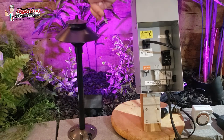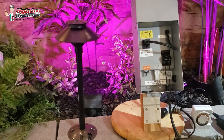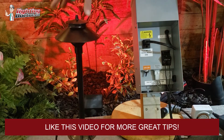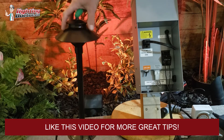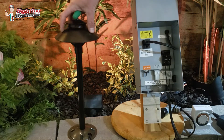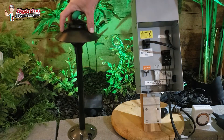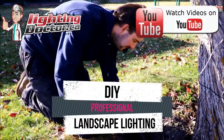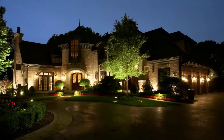Which means if you're starting at 15 volts, it just allows you to run a lot more wire and a lot more lights down that 12-gauge wire that we recommend, and not run into voltage drop. You can drop as much as 6 volts and still have this light operate with no hesitation. That's basically 100 watts of light on 300 feet plus of 12-gauge cable without running into any voltage drop.